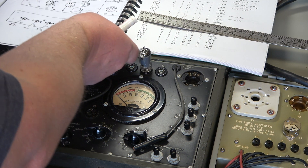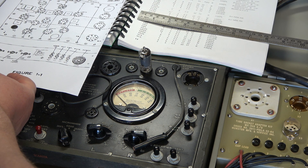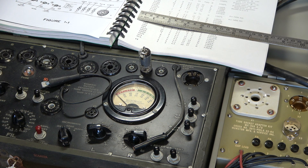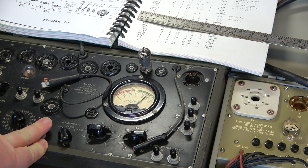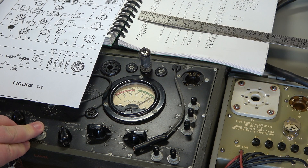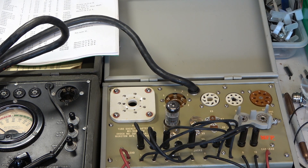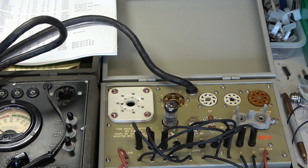What I've done now is photocopy the service information and we'll just cross these off when they've been tested. Valve 11 is in — yeah that's fantastic. Valve 9 is in — that's fine too. The next one: I've set this up as the supplement says and when I press the test it's not happy at all, so we'll turn that off and go back to the simpler tester.